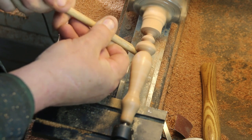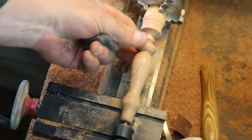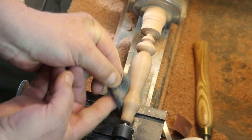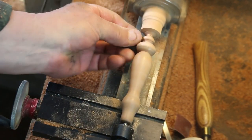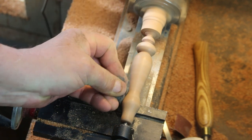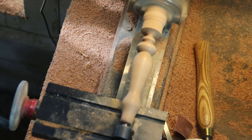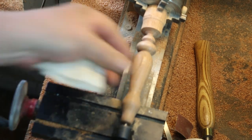A hardwood dowel and a little bit of burnishing — this burnishing makes the handle really smooth in your hand. Last little bit of steel wool for final smoothing — this is 4-0 steel wool, the only grit I have in the shop. Can't see it but that steel wool gets pretty hot in your hand, almost burning. Burnishing into that and a final touch with the hardwood dowel — easy to finish on the lathe.